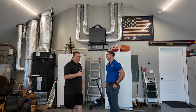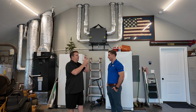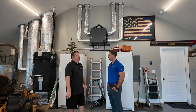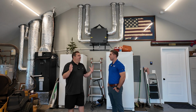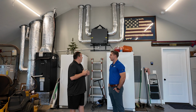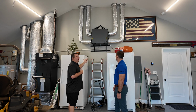And you know, the way a normal house is built, your roof has a gap in the top so air can flow out, and then air can flow out underneath, basically the soffit vents. So because we spray foamed all that, there's really no air that's going to go in or any air that's going to come or go out.